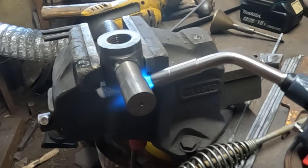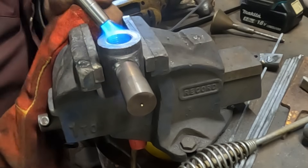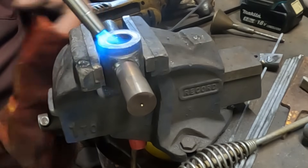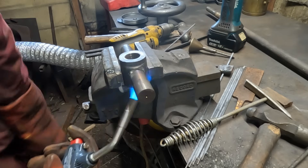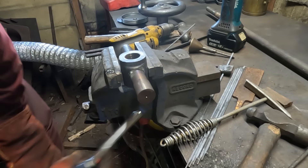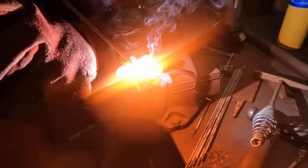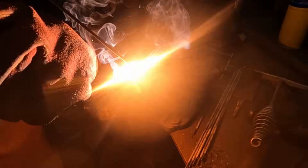For small parts like this a torch is enough, and I just need to focus on the area around the weld. My main concern here is fractures running parallel to the weld caused by contraction of the bead, so I don't need to preheat the whole part. There is no risk of stress on the rest of the casting because the welded portion can expand into space. The hand wheel, on the other hand, is a completely different story and will be treated differently altogether.